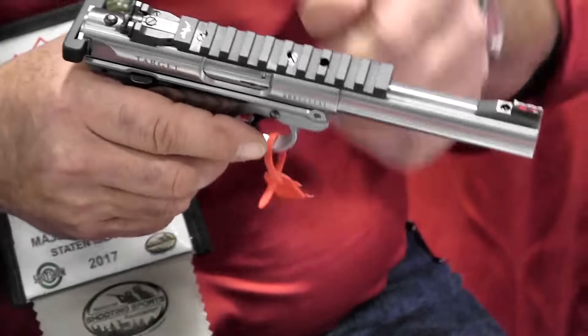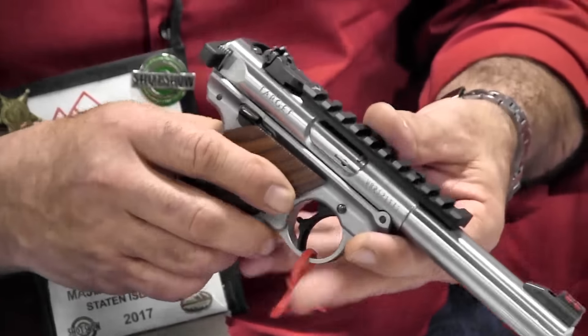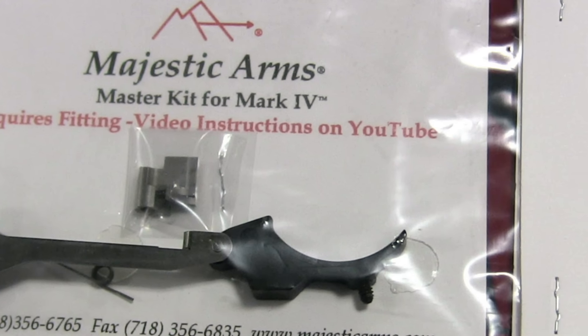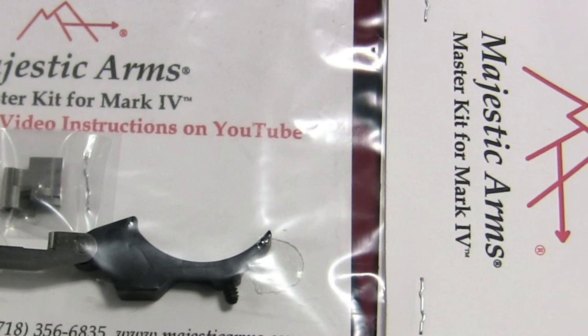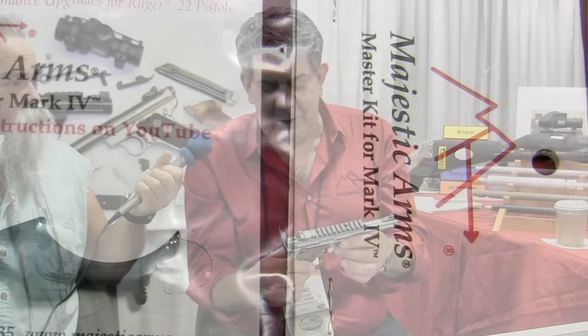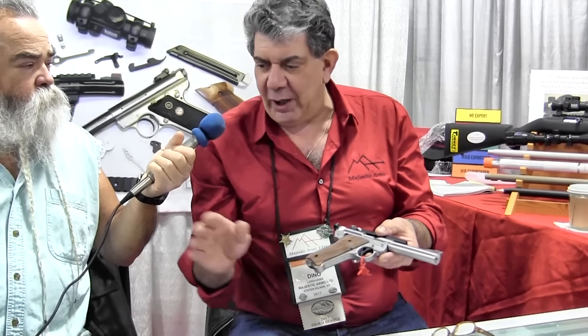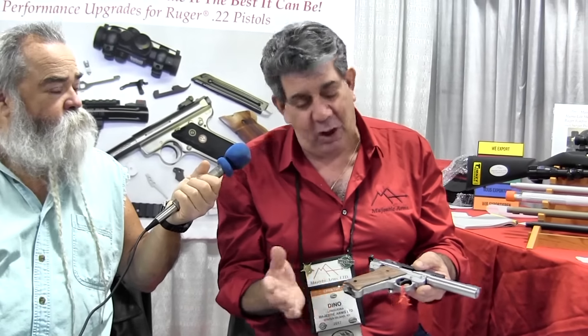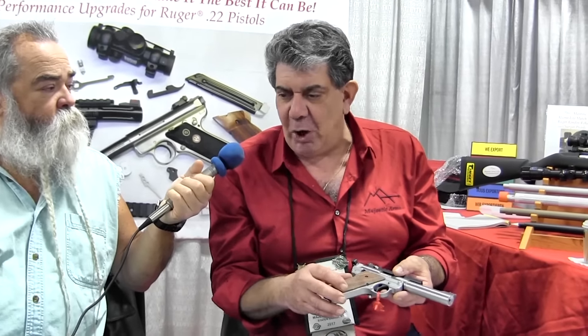The main thing is people were immediately asking for a better trigger kit. So what we did was we came out with the master kit. We've already had it for the Mark III and we've been selling it for over a year now. We adapted and came out with a brand new one for the Ruger Mark IV. I give you a complete package kit with every single part you'll need in the whole fire control package. Our kit now allows you to either omit the magazine disconnector or maintain it — the choice is yours. My parts are machined to use both and we package it with the bushings if you want to get rid of it. If you want to keep it, the hammer is machined to accept it.